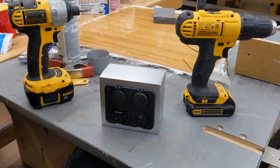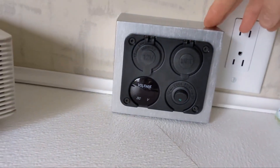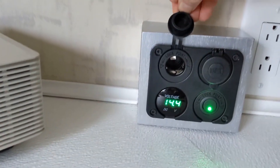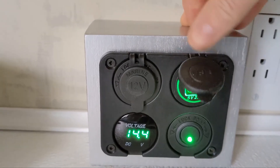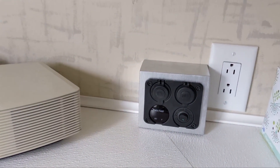It's a few weeks later but I'm finally finished. It's a cloudy day today and we're still producing like 22 volts out there — battery just went from 13 to 14. I finally got this other display panel in over here too — this is my secondary, the one I'll use most of the time because it's easier to get to. I flip it on, it calibrates, and it goes up to 14.4 — that's telling me exactly what the battery's got right now. It's got a 12 volt outlet and two USBs in there as well. I like this one because I can just shut it off when I don't need it so it's not using any energy.